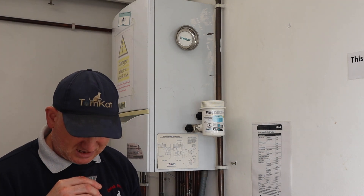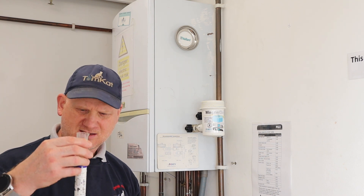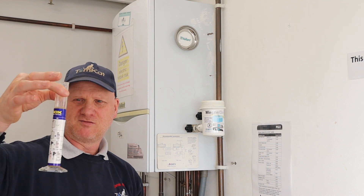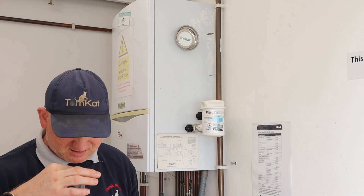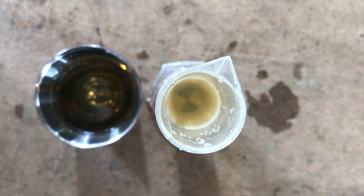It's a bit cloudy and a yellow colour. I wonder if that's the inhibitor we put in, but it's definitely cloudy. I've filled it up just past the mark. Looking at the water in the turbidity tube, you can see we can only just about see the bottom. I don't think it's magnetite — I think it's more the inhibitor, because if you saw part one you'll see we dosed massively on this heating system. So let's dip the test strip in and find out what results we get.